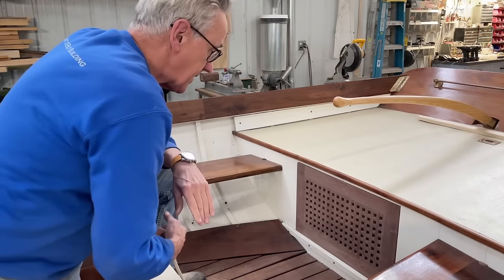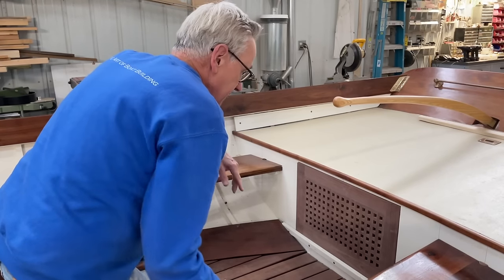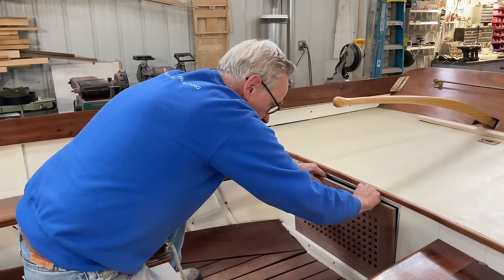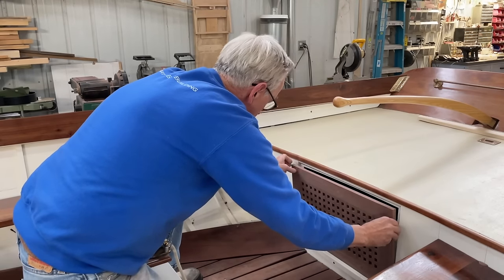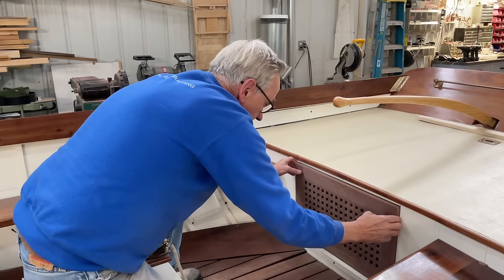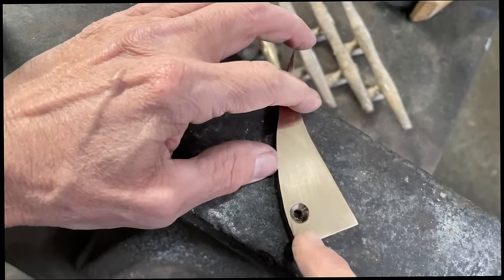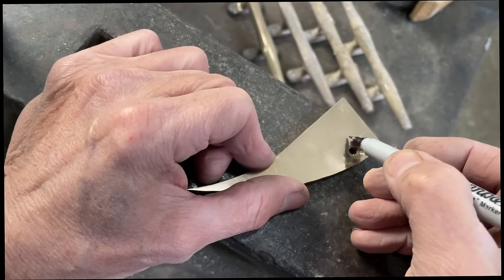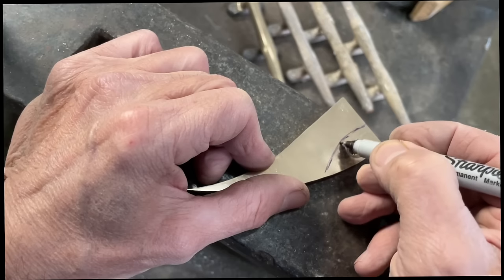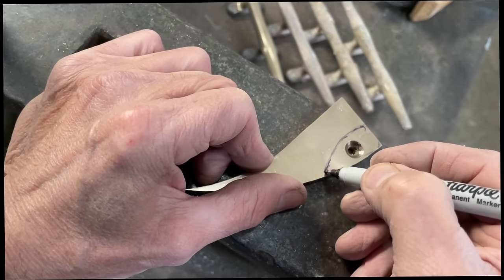That fits pretty good. I did have to trim it up a little bit on the top — took about a sixteenth of an inch off. So what I think I need now is some kind of little clips here to hold it when it's in there. You can see down here at the bottom I've got a little trough for it to sit into. So I need to figure out some kind of little turn pieces for right here. I found this little piece of scrap that already has a hole in it from when I changed the seat post, so if I match this curve here and round the corners a little bit, I think that will work really well. I'm going to cut this out and polish it up.